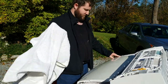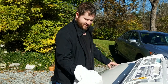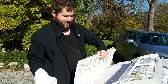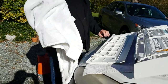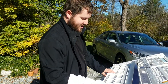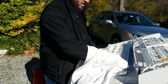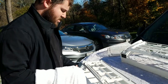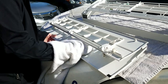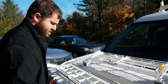And that fuzz, if it's just dirt, it's pretty easy to spray the dirt off, but fuzz is a little extra challenge and annoyance. When the fuzz gets wet, it wraps around different parts of the unit and becomes hard to spray. Why sometimes you need a good towel. In there, get that water on the inside. Don't want to leave too much water in there.